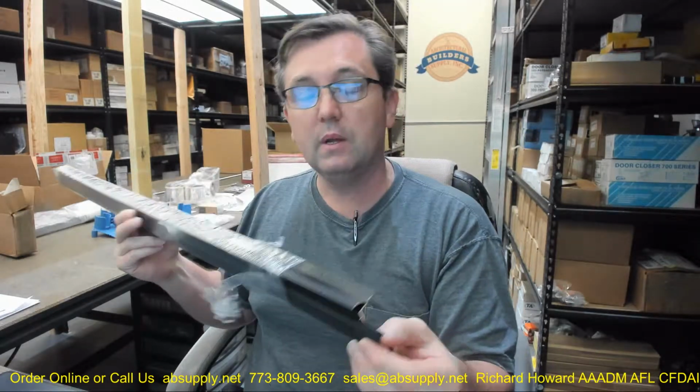The other option from Hager would be vinyl, and vinyl would be used only if economy was the most important aspect to sealing the bottom of the door. I couldn't really see ordering a unit with a drip cap and then going with an underpowered insert like vinyl, which will fatigue with extreme temperature and ultraviolet.